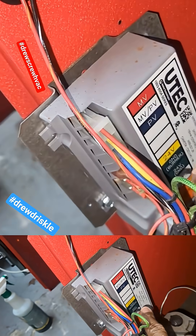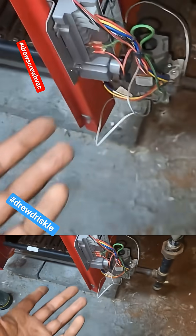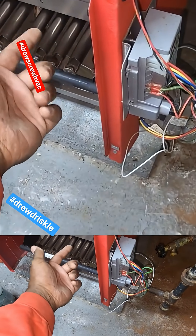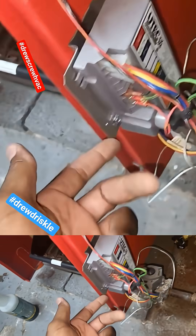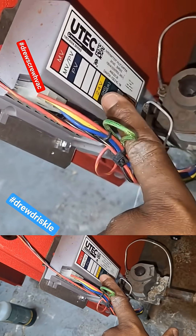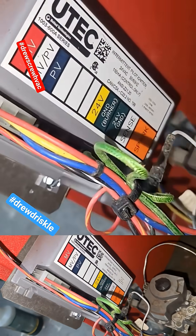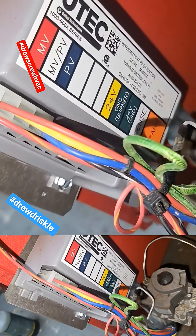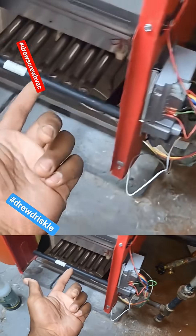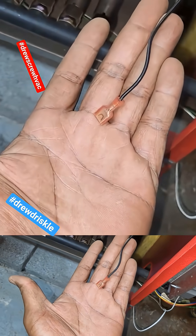It starts first with any control — you need to test for power. You have your 24-volt terminal. If you run across a no-heat scenario on a spark ignition boiler or a furnace and you're not getting ignition, maybe you're not getting spark — before you condemn gas valves, condemn igniters, or condemn boards, make sure you can identify your 24-volt terminal and make sure you have power at this module before proceeding with your diagnosis. Because if you don't have power here, that's when you refer back to your schematic and figure out if there's something else in the 24-volt circuit that's stopping power from getting to your spark igniter.